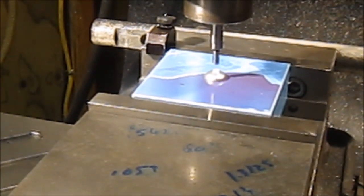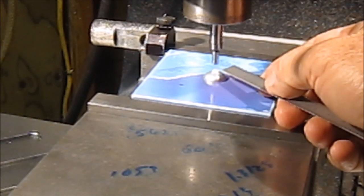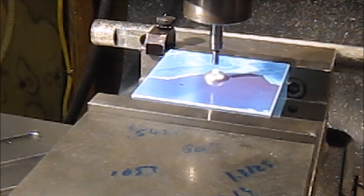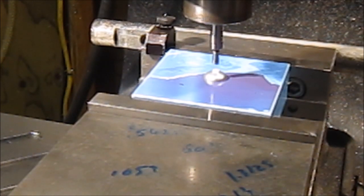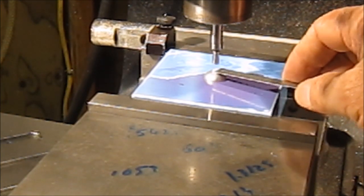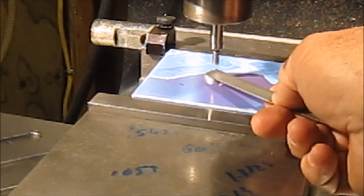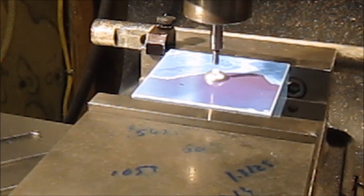And thinking about this, looking at the two parts where the plastic snapped, my assumption was it was kind of clean cut and jagged, similar to cast iron breaking. Well, it's not. So to make this a little cleaner and simpler, I'm going to basically mill a flat here, and then on the corresponding part mill a flat. So that way I don't have to sit there and try to fight the little jagged pieces there that aren't true anymore. So we'll mill it first and then we'll drill it.